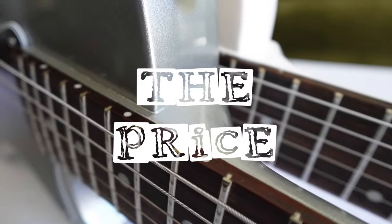Now moving on to the backside of the electronics here, the cavity looks real nice and clean, actually. Looks like modern wiring. It's hard to see, but it looks like these are both 500K pots for the tone and the volume. Gibson likes to use those a lot now. And an orange drop capacitor. Nothing surprising in there. Tight, clean wiring. Now let's move on to the Epiphone.